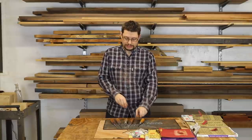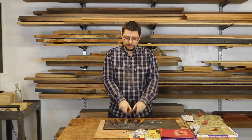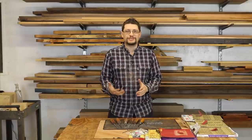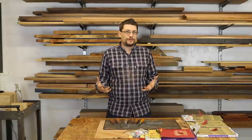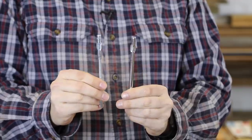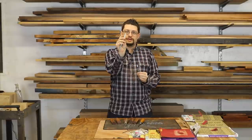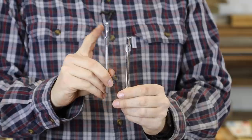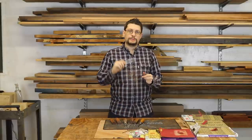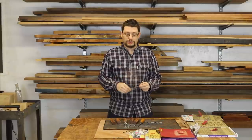I milled up two sets of blanks — one thicker or wider than the other — because even though I spent a lot of time and care choosing the shanks, especially since the Lee Valley ones are no longer available, I had to find a great source elsewhere. I took care to make sure the actual thickness of the shanks themselves, no matter which one it is, is exactly the same, and the wings that help when you're torquing the screwdriver to keep it set into the handle and prevent it from moving are the exact same thickness across all five different shanks I'm using.